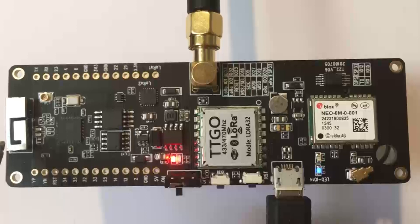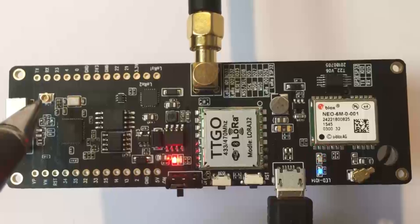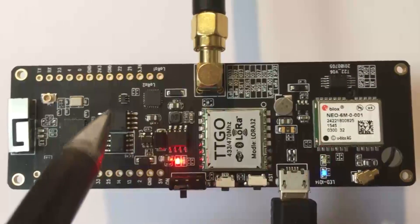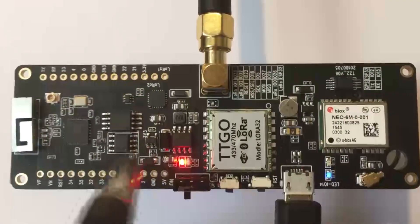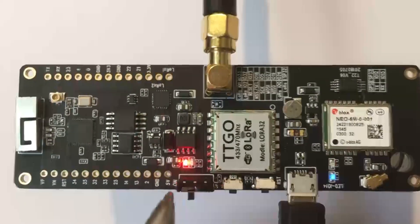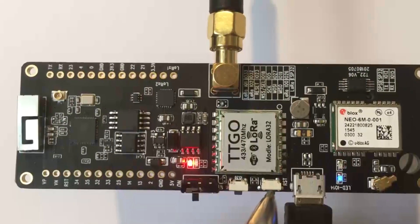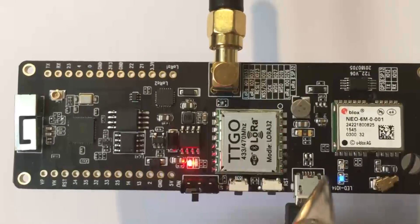The ESP32 has a 3D Wi-Fi antenna on board for external Wi-Fi connection, a 40 megahertz on-board crystal, 32 megabit flash memory, a CP2104 UART, 3.3 volt regulators, an on-board battery charger and monitor, an on/off switch, and a general purpose IO switch on GPIO39.